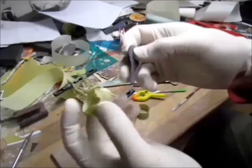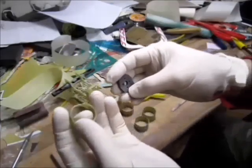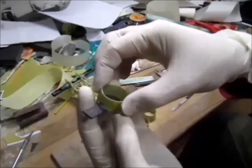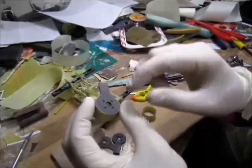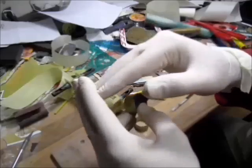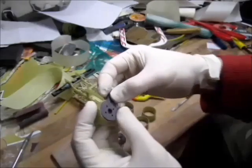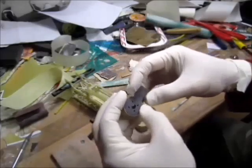Got my motor mounts cut, so I have these nice fiberglass rings to go on. They're 1 millimeter thickness. Start notching out, and I can start gluing. That's for my motor wires to come out. Once I glue this one, then I'll double the other one on top, and that is to make sure I have them interlocking with each other to be stronger, because if I simply fold this one or put it on a double in there, it's not gonna hold, as it's only by a little angle. So all the parts have to interlock for the strength.